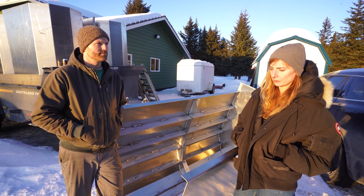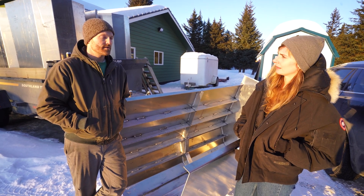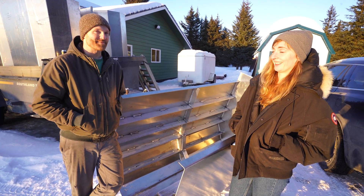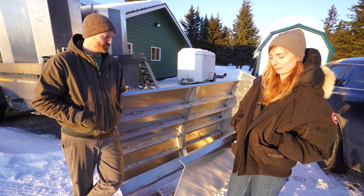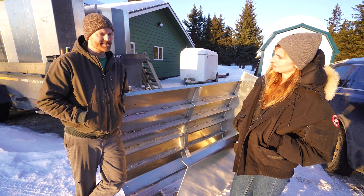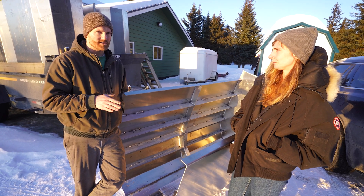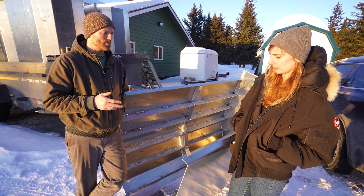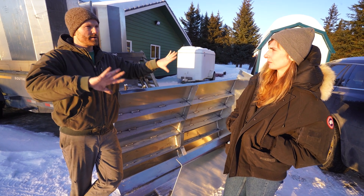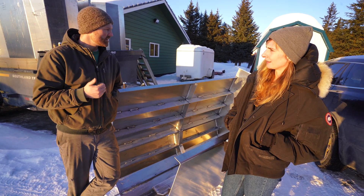Some people are asking about why aluminum for boats in general. Well, the alternatives are fiberglass, wood, steel, or inflatable. There are some guys that have inflatable stuff on their dredges. We are going with aluminum because it's fast and versatile to cut and weld. It doesn't rust like steel. Fiberglass requires basically a huge mold where you'd have to lay in fiberglass, and these are custom built. So for aluminum, it's great for us — no rust, corrosion resistant.